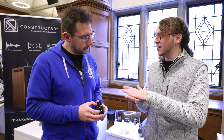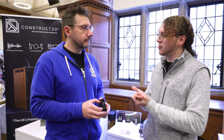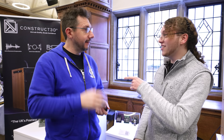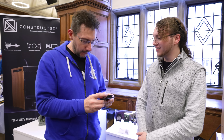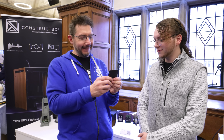I got the entire idea from Ooznest. I've got an Ooznest CNC router — amazing little machine. The way that they touch off is you just put a bolt on the drill bit and on the piece and it touches and it makes a circuit. I was thinking if you do it in reverse, you break the circuit, you do the same thing — you know exactly where you are. It's good enough for CNC work, it must be good enough for 3D printing. Instead of having to lower to a point to hit a switch, you're essentially saying as soon as it hits the bed, we're done. And because of that, whatever nozzle you put in, you don't need to put an offset — it just works. So you can swap nozzles out and just play happy. The rigidity is there, and that's just in two walls of PLA. That is not a special bracket at all. I'd like to make it out of aluminium to make it really rigid, but so far that has been extremely performative.